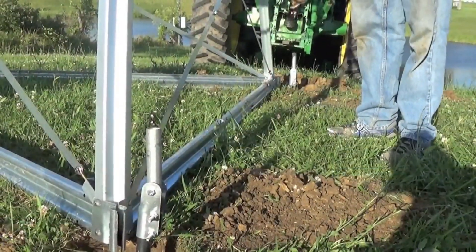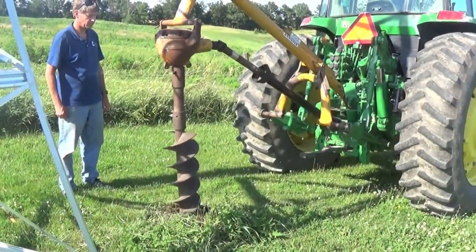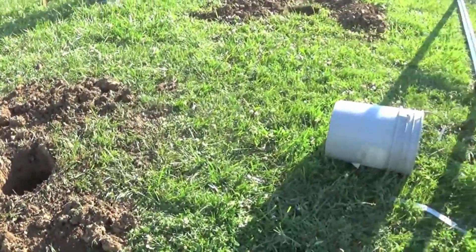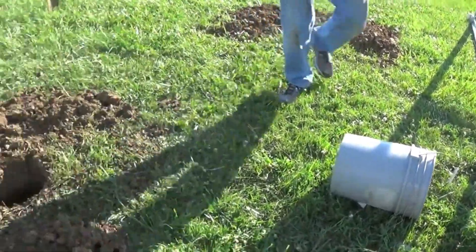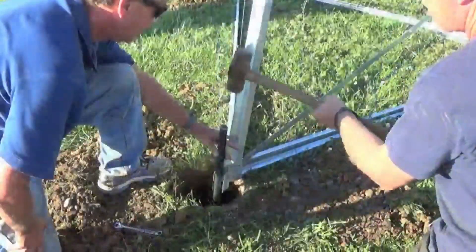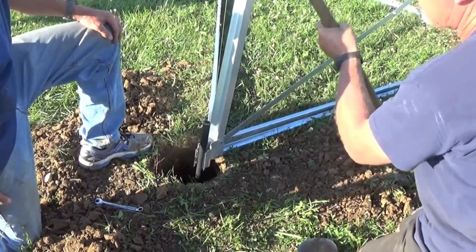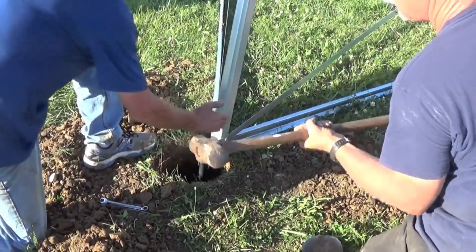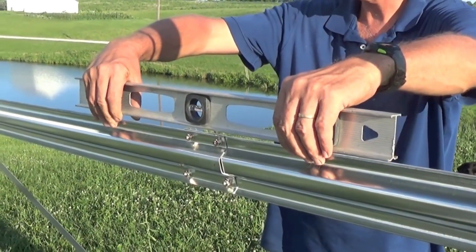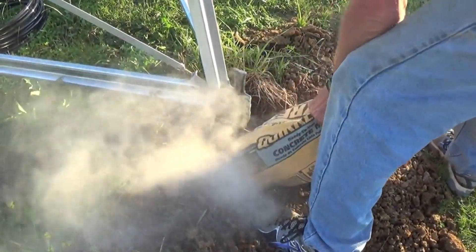One possible option for anchoring your windmill is as follows. Mark where the ground stakes need to go. Slide the windmill over slightly and dig 30 to 36 inch post holes around each ground rod. Slide the tower over and center over each hole. Then, using a sledgehammer, drive the four foot stake rods into the ground after you have positioned them in the stake clamps. Secure the stake clamps to the ground rods using the bolts provided. Level the windmill tower before tightening all bolts, then fill with a concrete mixture of at least two bags of Quikrete per hole.